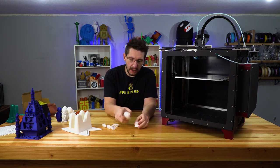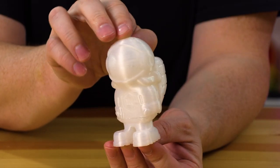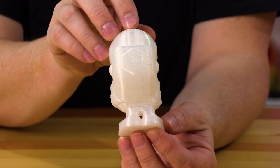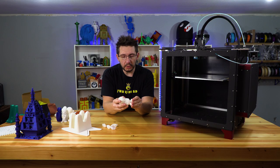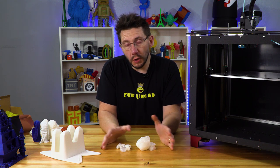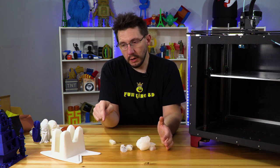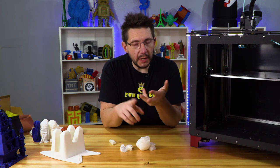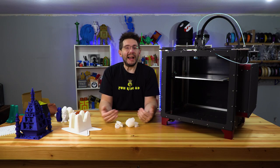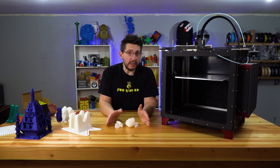You may find some tips for nylons in the comments. I dried the nylon and tried again — same thing. I thought maybe the overhang caused the nylon to curl, preventing it from sticking to itself. The individual sections of the print are nylon-strong, it's just the connection point that didn't work. The same models worked on the Prusa using the same temperatures, print speeds, bed temperatures, and layer heights. I'm guessing it was something in my configuration — I'm willing to bet that with more time I could get nylons printing no problem.